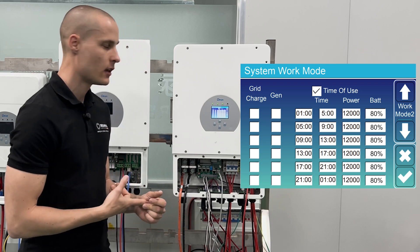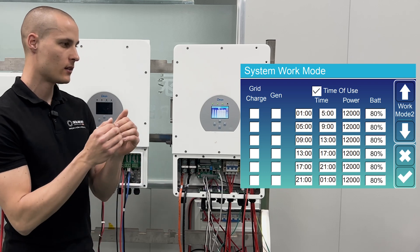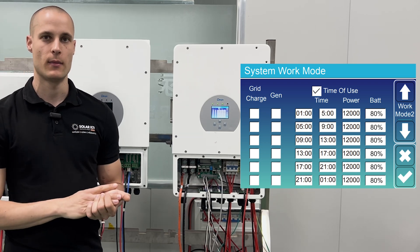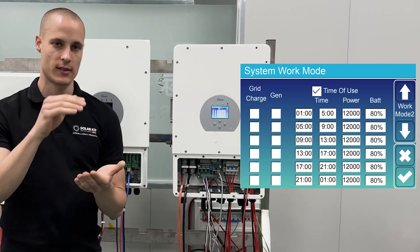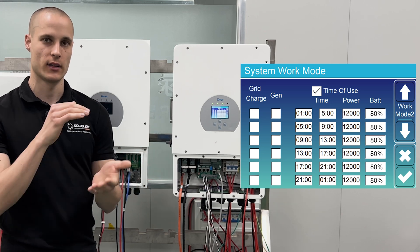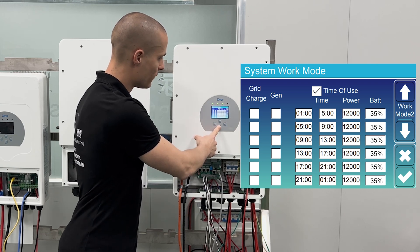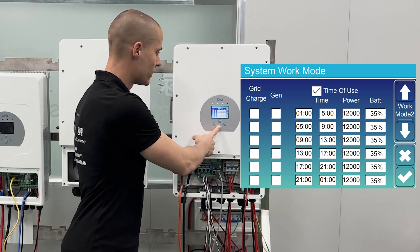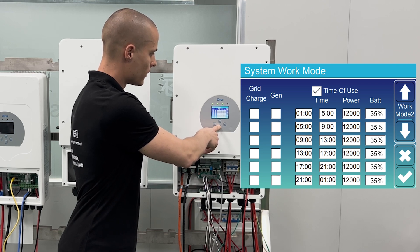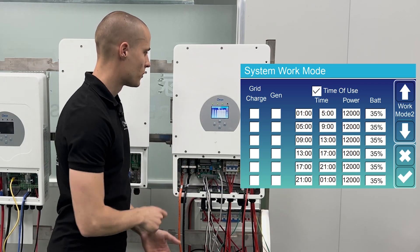This allows us to manage battery discharge. By default, the factory settings for battery values here are set to 80%, specifying how much the system will discharge the energy stored in the battery while protecting its longevity. It's worth adjusting this to the 35% set in the battery settings menu. We click on the 80% value and decrease it — it will automatically stop at 35% because that is the preset limit for the battery.